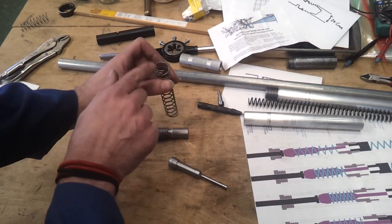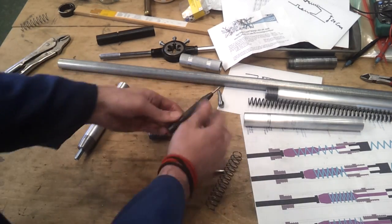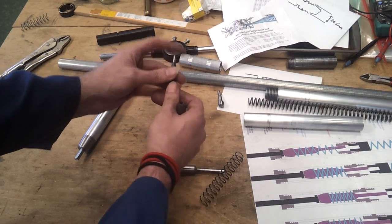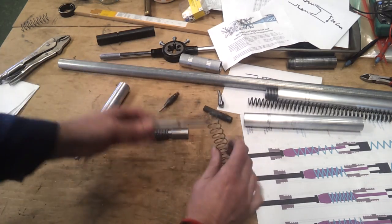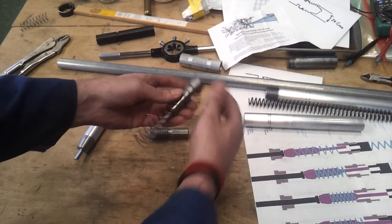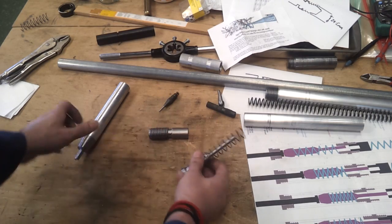I've also had a quick go at the spring and found that with a couple of pairs of pliers I was actually able to bend it in slightly at either end. If you look at the original, they've actually got a slight tapering on the spring. By tapering that down so it just fits there, it's not going inside and it also tends to hold it at a slight angle, which is good because I want it to start at a slight angle.